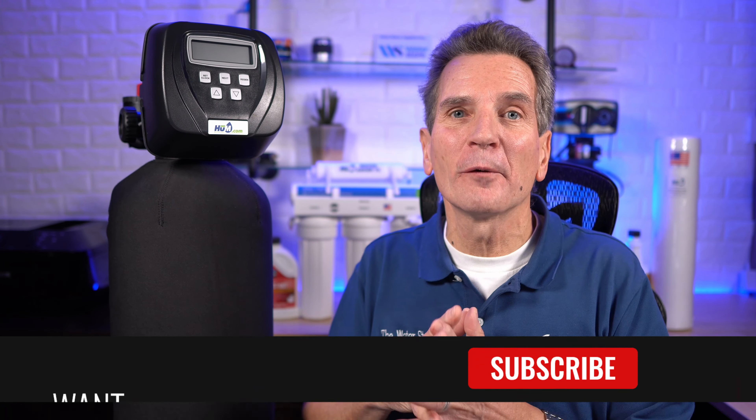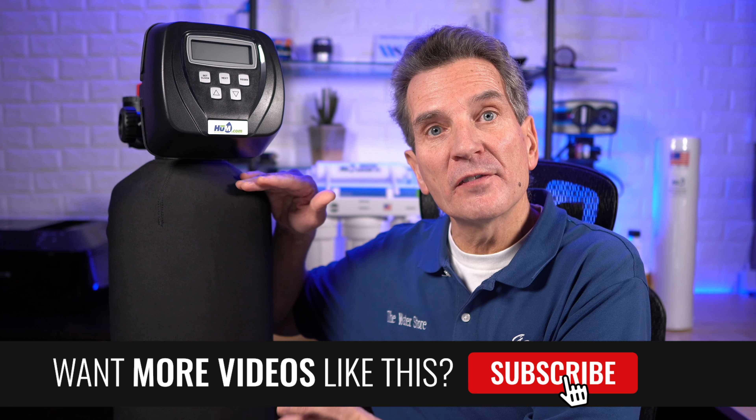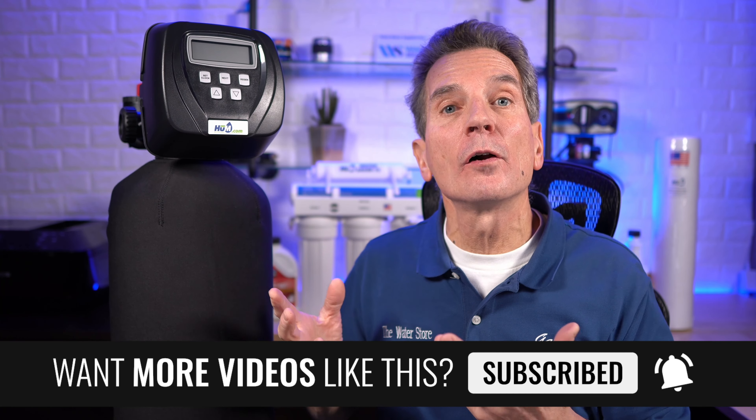At this point you may be thinking, hey Gary, what's the rocket science here? All you do is just fill up the tank with media and away you go. Well, no — it doesn't work that way at all. You need to leave some space above the media inside the tank. That's called freeboard, because when the media backwashes, the media expands and opens up to flush all the debris to the drain. If you put in way more media than it's supposed to have, it's just not going to work at all.